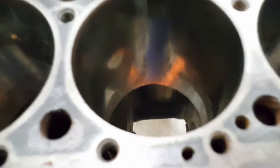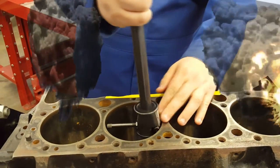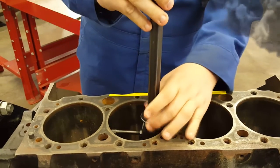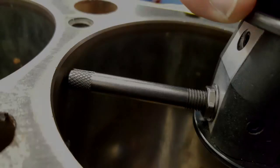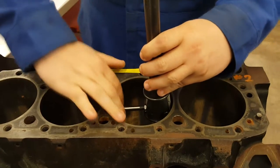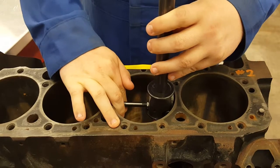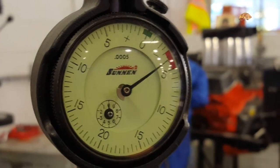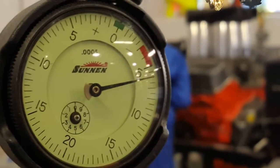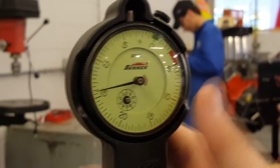With the correct attachment installed, place the bore gauge into the cylinder. The extension end should be moved just below any visible lines created by wear. Once properly seated, begin to gently pivot the gauge back and forth on the extension end. The dial indicator will move along with it. Watch the dial carefully. As you move the gauge in either direction, you will notice a point in which the needle starts to reverse. This will be your zero mark.